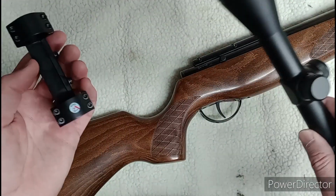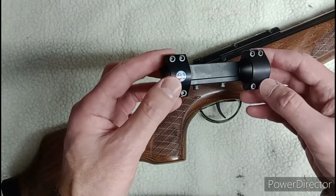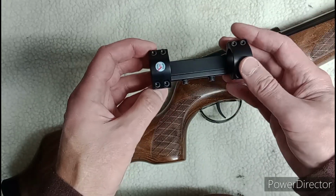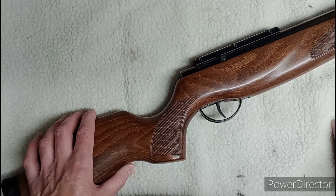So how are we going to resolve that? Just grab a file and whiz a channel in this and then black it. Yeah, just get some aluminium black on it and recolour it, and there we go, be fine, all be good. Right, which bit first? Let's do the butt first.